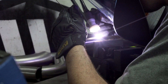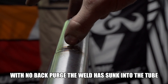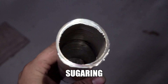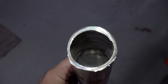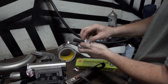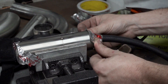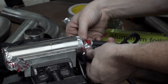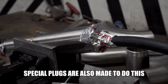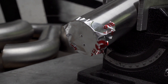In order to weld stainless headers, you need to back purge the tube. Back purging is when you put shielding gas inside of the tube to keep all of the weld puddle from being pulled in by gravity and heat. Without back purging, you often end up having a thing called sugaring happen on the inside. A properly back purged tube will look almost identical to the way it does outside, because the shielding gas has resisted the weld from falling into the tube. In order to back purge your tube, you need to seal in a purge hose from a dual regulator and evacuate all the oxygen out of the tube. The way this is done is really cheaply with aluminum foil and aluminum tape to seal up both ends of the tube you're welding, and then you put a couple of holes in one end of the tube to allow all that oxygen to escape. Argon tends to push out that oxygen if you tilt up the tube a little bit.